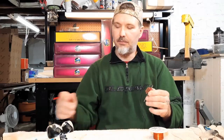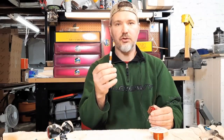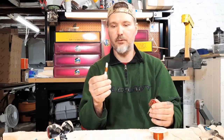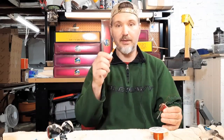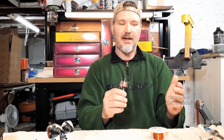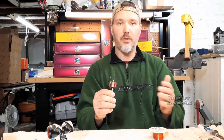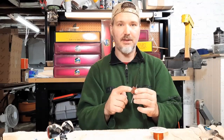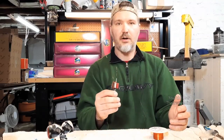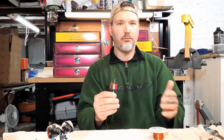How much wire did I cut off after winding this segment? 10 feet — yeah, that's a lot of wire to cut off. I took the excess wire and wrapped it around a straw to save it for future projects, maybe a small LED project or getting wire into a tight area. So the segment actually used about 25 feet. I had guessed 27 feet earlier, and that's pretty close. So I'm going to cut off about 27 feet of wire for each segment and complete rewinding the armature.